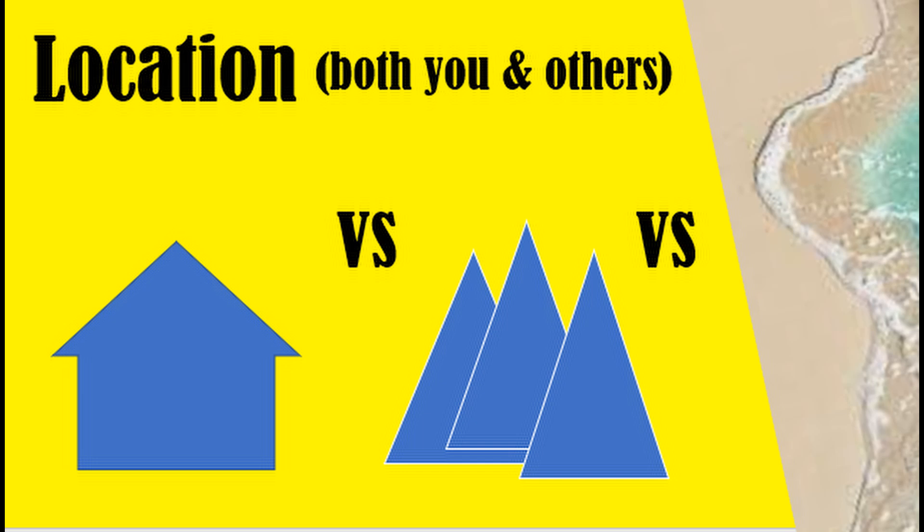Location — that's really important. For microwaves, you need something really high up with good line-of-sight type propagation. And you can do really well with super low power on microwaves, mainly because the antennas are small but you can get 20 or maybe 30 dB of gain with something like a horn antenna. Then you can run microwatts and still get surprising distances. Even if you span a distance like 100 kilometers or so, you can still get impressively high miles per watt — or kilometers per watt, if you prefer.